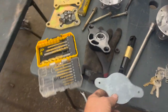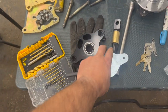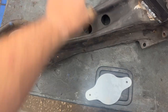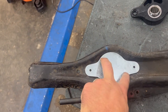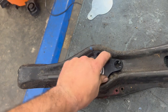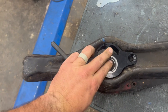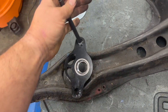The trailing arm spherical bearings come with these little plates that you can use to drill your holes. The thing is this fitting sits in here tight in one spot so it can't move around. What I'm going to do is use a center punch that actually fits this hole snug — it fits it snug — so I'll put it right here, punch it, and then drill my holes out.